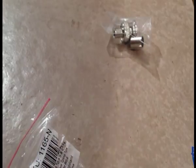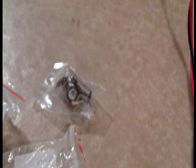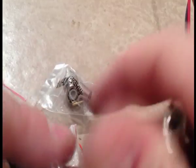Now, you take, let's get this meter out of the way. You take your F connector twist on, and this is toolless, except for a utility knife. And you see that after I pulled the insulation back, and the pin, you want it straight, because it's going to make it easier to get in the hole. So, I'm going to straighten out the pin. Is this copper clad steel? Very likely. It feels very stiff for copper, so I think probably the answer to that is yes. Now you can see down here there's a center hole just like you saw in the other one that the pin goes into. So all you do is you place it onto the connector and you just twist it on.